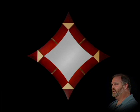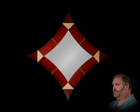Here is the four-point star mirror hung the other way, where it can have a dramatic effect. I like to make this mirror with two ways of hanging it on the back so that someone can hang it conservatively in the square fashion and then move it a few years later in a more dramatic fashion. This particular finish is done on top of just a maple ply, but it is a tinted finish done in the fire pit fade or sunburst appeal, like is done with a guitar. It has maple onlays and maple and tulip wood inlays. The reddish wood is actually a maple wood with a tinted finish — the finish has suspended color applied in layers to have darker and lighter areas. Underneath it is just white-colored wood.